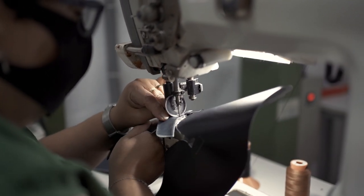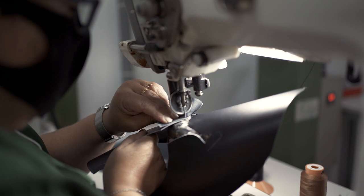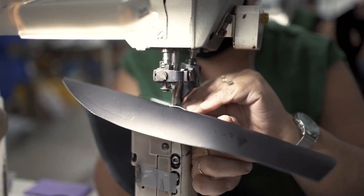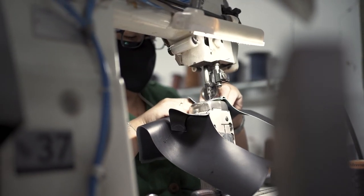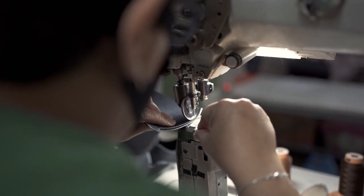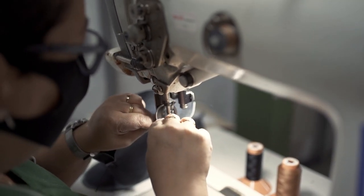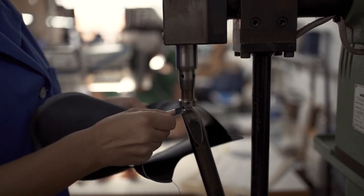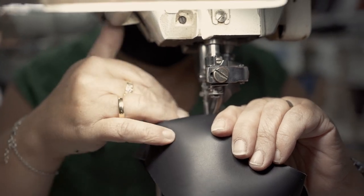Here we've got Ankarna who's stitching the upper of the shoe — the outer shell of the upper. It's only the black leather at this point. Those layers get stitched separately and when they're finished they get joined up and stitched together. Ankarna is stitching the back seam, which is a closed seam on the Brawler model, so the upper is turned inside out. These stitches need to be hammered in order for them not to poke out too much when the lining is laid on top.